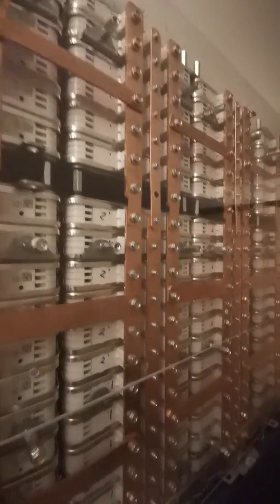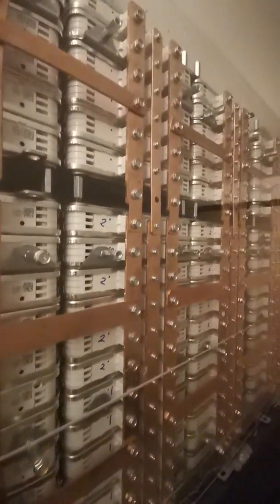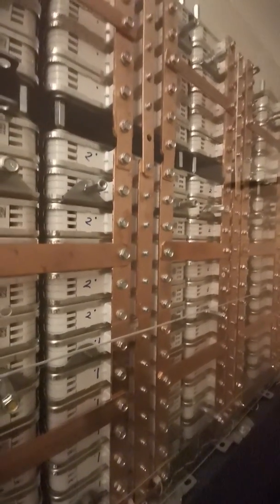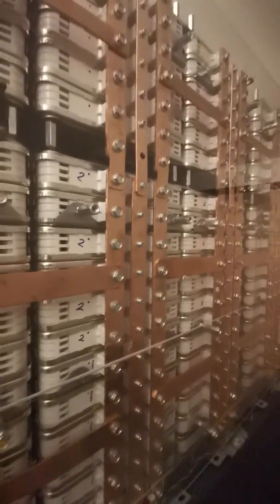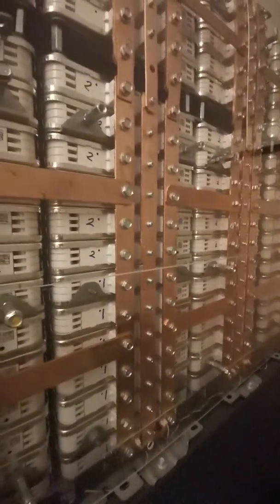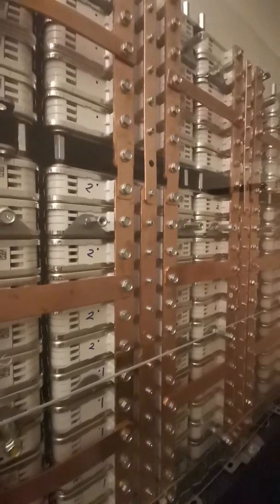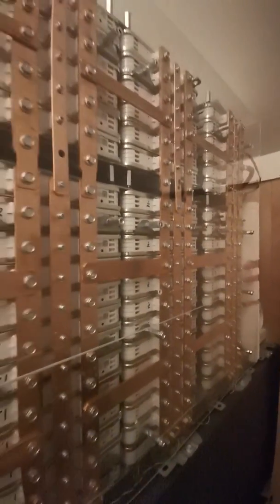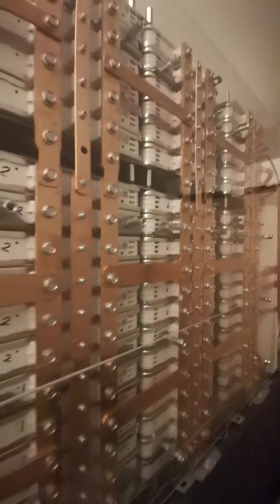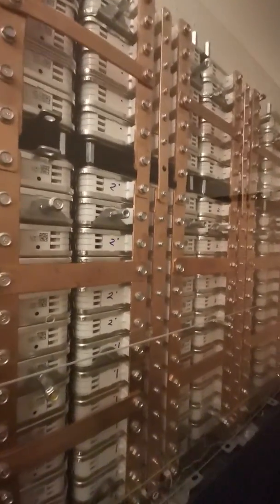As I've got them like this — I've stacked up a huge stack here. In these particular ones I've got, I think there's 20 in these stacks. Each module has two cells in series, so effectively each stack is really two stacks of parallels that are each four volts. If you pile yours up, you would want to divide the number of cells by seven, because you need seven times the eight volts nominal to give you 50-something volts for a 48V system, then pile up in multiples of seven.